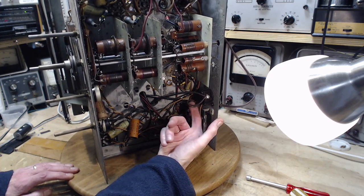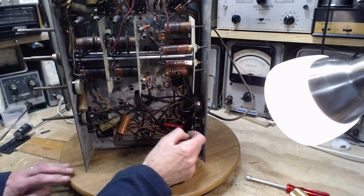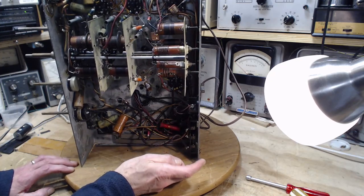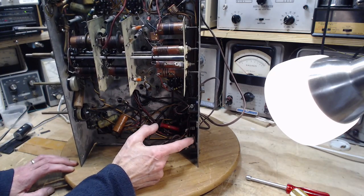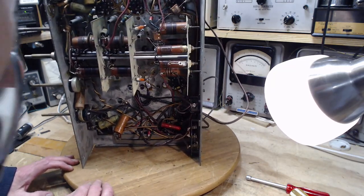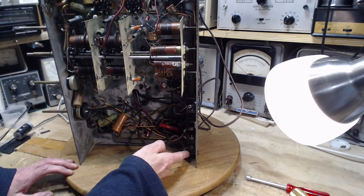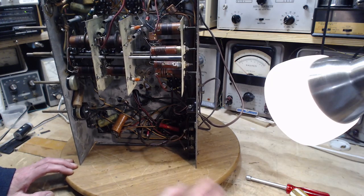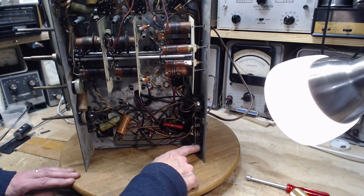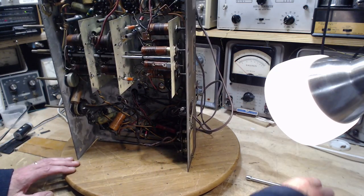So this outlet is hooked straight up to the wires coming in, which are not properly relieved. The fuse in here doesn't look right. So there's a fuse position here, but it looks almost like you'd snap in a fuse that's this long. That's really weird. It has a center terminal. I've never seen anything like that. This is open here. This fuse doesn't seem to be the correct size. You know what else? It looks like a 30 amp fuse in there. It looks like an automobile fuse.